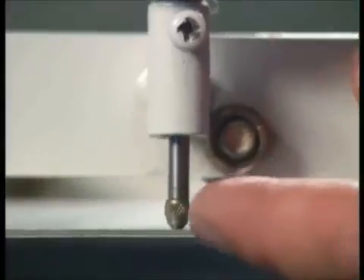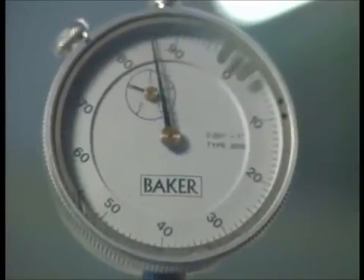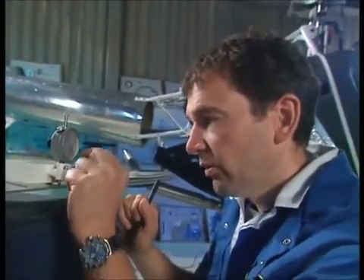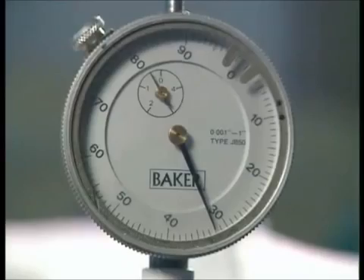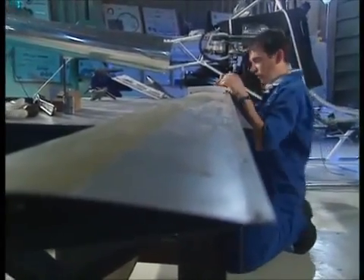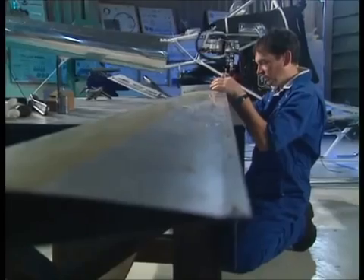This is the beauty — you can see the airfoil shape here, and it's got all these rollers on it to sit on the blade itself. Down here it's got a little plunger that rests on the trailing edge and gives you a reading on the gauge. What I've got to do is measure between every two rivets all the way along, and then bend the trailing edge to make sure that the gauge doesn't move by more than two thousandths of an inch. Twenty-six, twenty-nine, thirty-two — it's so much better having the proper kit.